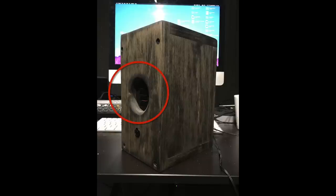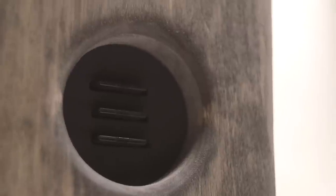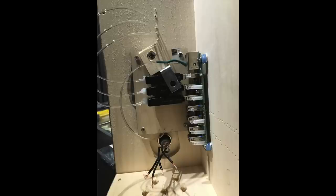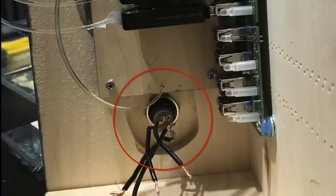When it comes to actually mounting everything, I drilled a large two-and-a-half-inch hole in the front of the unit rather than trying to route a perfect hole since I don't have any jigs. Then I used a really thin piece of wood pre-cut to have the card slots — I used chisels and carefully cut those out. If you have a Dremel and are good with one, that could be easier. In this photo you can see I screwed the hub directly to the inside wall, then plugged the SD card slots directly into it. I stuck the cards through, positioned everything, and screwed it all down. That little L bracket keeps the cards from pushing back into the enclosure when you insert a card. At the bottom you can see the switch in place — they just screw on, and I routed out a little bit of wood to get the nut on there.